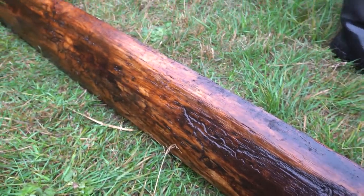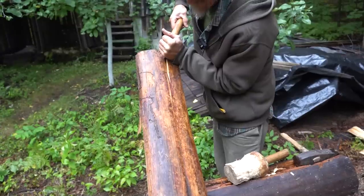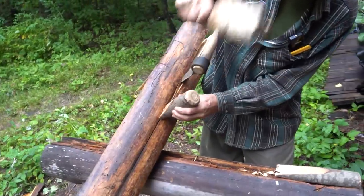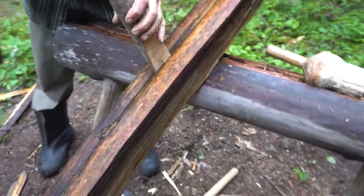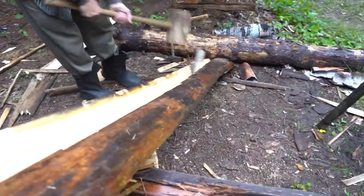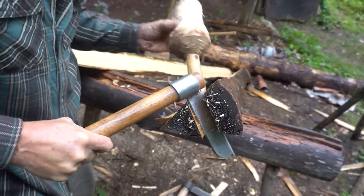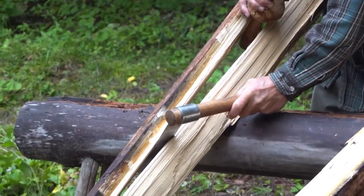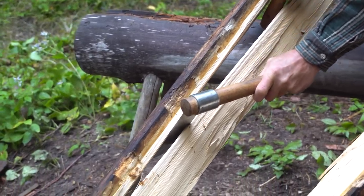Or if it's green right off the tree, it works good too. This is the cedar quarter I've been soaking. Right now I'm in need of ribs, so the whole point of this is to make a million more ribs. This is what a wood-right does — you get the tree in the woods, get the right tree, and then you know how to split it up into all the pieces that you need. You don't really need a saw, but you do need to understand how wood behaves.